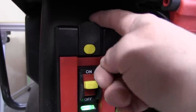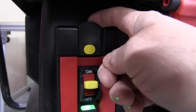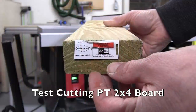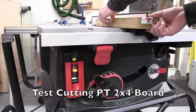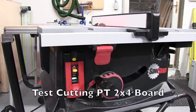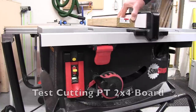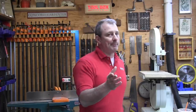There is also a plastic key that allows you to disable the bypass mode. If you suspect a material might activate the cartridge, use bypass mode to test conductivity: place the saw in bypass, make a cut or two, and if the red light flashes fast that material is too wet or green to cut. If that happens you must keep the saw in bypass mode, because once you cycle the power switch it defaults back to protection mode — so you have to re-enter bypass every single time.